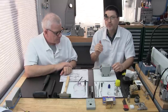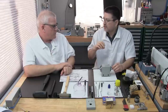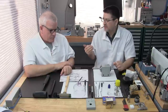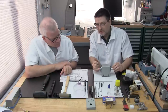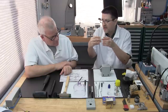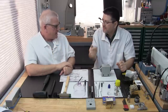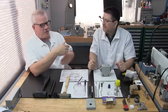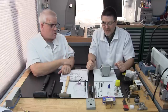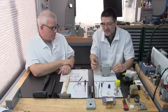There are two cases where we need to regrind the collet seat. If the total indicator reading doesn't look very good, if it's not within the specification of 50 millionths of an inch. Or sometimes a collet seat will just get worn out, because as you're tightening and loosening the collet on that collet seat, after some years of use, the collets have made their cozy seating in there. And it needs to be revisited and refreshed to get a nice fresh surface, and that'll bring back much better accuracy going forward. Exactly. So those two conditions are when we'll regrind this collet seat.